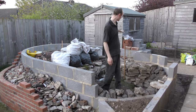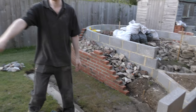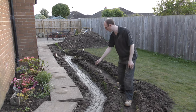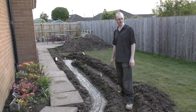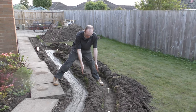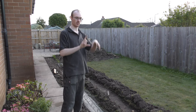Unfortunately we've got more radiuses to do, because we've got another one there to do, and this even tighter one round here. Then even when we get into this section here, we've got another two, although shorter ones. However, once we get to these longer sections, this should go up a lot quicker because we're not down as far so we don't have to put as many courses on, and they're straight. It's going to be higher, but not that much - probably only two bricks or something. We're not going to go up a massive amount. It might even be one brick with the L-shaped capping stuff, so that the soil sits on top of the wall.